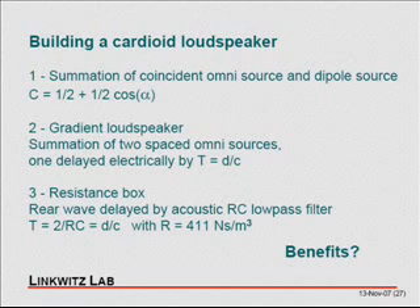It lets air through and is used for filtration purposes, but also as lining in ducts. Or if you want to build a heater with a flame covering a large surface, you have gas coming in on one side and a very uniform, controlled, reduced-velocity flow on the other side, giving you a large, uniform flame surface. That works quite well for this type of application.